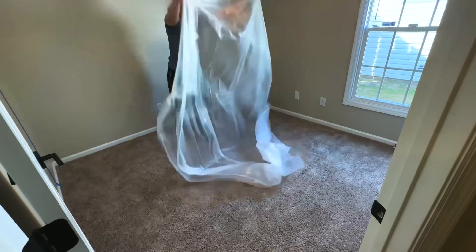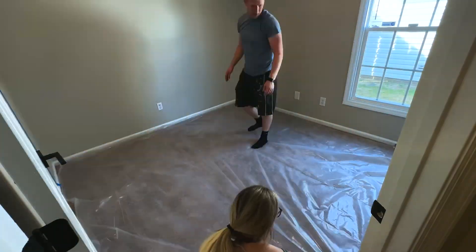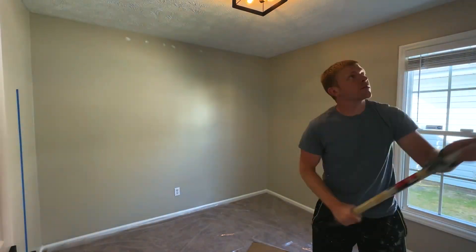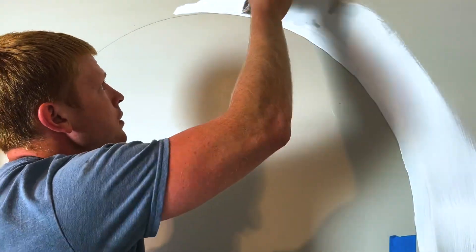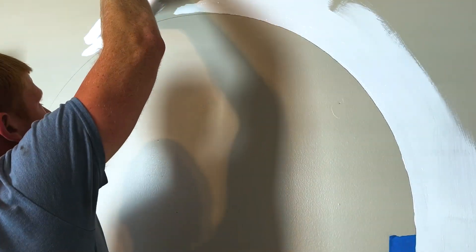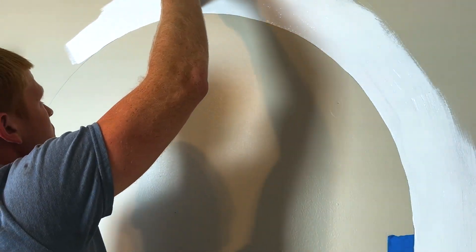Next up was plastic for the floor because I'm a messy painter and I'm going to get paint everywhere. Give the walls a quick sand so that new paint has something to adhere to. I went ahead and did the cutting in while the wife did the rolling. Tip here for cutting in is have a good paintbrush. I used to treat my paintbrushes like they were one-time use, and now I don't, so you shouldn't either.